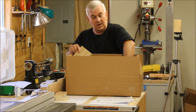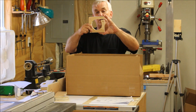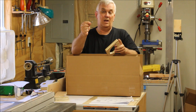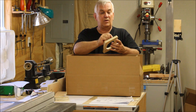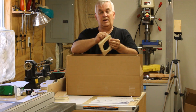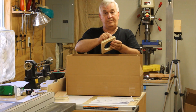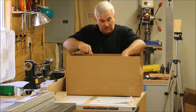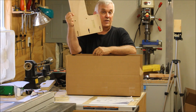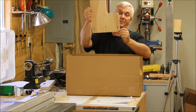Everything in your kit is already done and thought out for you. This router mount is made so you can either put a nut there, or I like to use these little weld nut tabs — you stick those in, drill your hole, and you've got something to pull to. The tab is just long enough it won't turn. Sometimes a pressed-in nut may loosen up over time, so these are even easier. I've also done similar things with these little rectangular slots — when cut with a round bit they come out as oval slots.